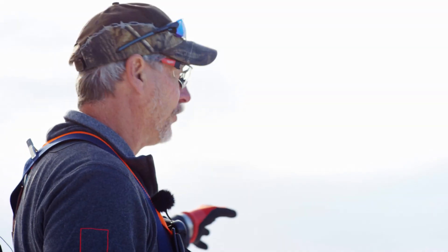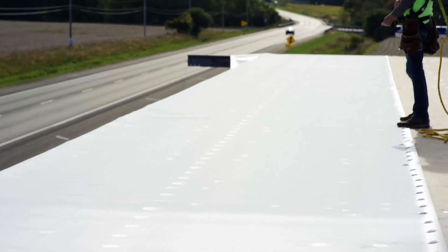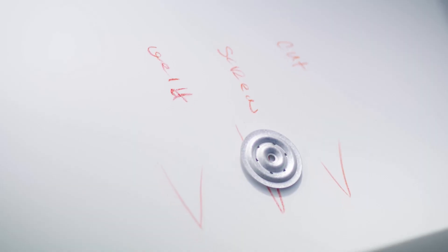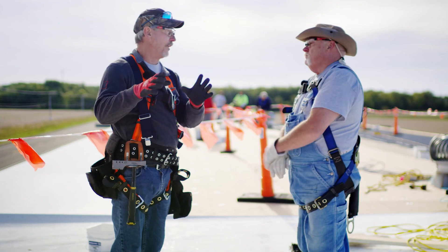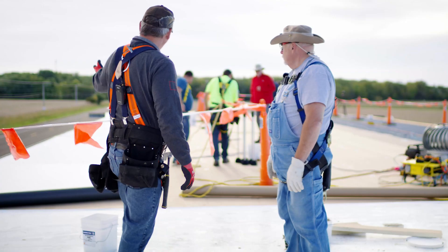Something else to think about: we've talked about chalking lines, and you definitely have to be on the money when chalking these lines. You can see that guy right there — he's attaching into that purlin. If that sheet is running off and you don't find that purlin, you can't just leave that screw in there because you're not attached to anything. It's very critical those chalk lines are right on the money. This is why we mark things as we're laying insulation out — don't lose that purlin.